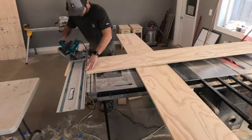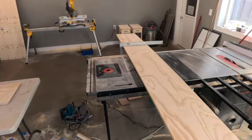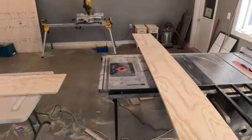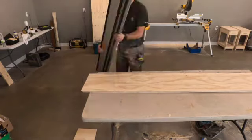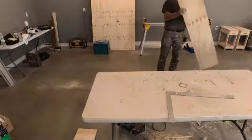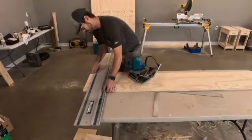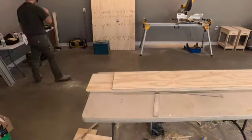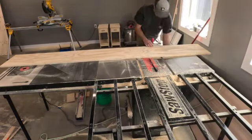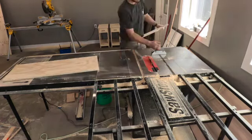For 45-degree cuts like this, I prefer to use the table saw, but these pieces were too long to run through the table saw and I don't have a sled, so I just used my track saw for it. I missed part of this apparently. Before I cut the 45, I cut it straight and left about an inch overhang, so when I do cut my 45, I don't have a long piece of plywood fall off and rip my nice cut to shreds. This Makita track saw with a Diablo blade works pretty good — no clamps and I ended up with a pretty square, nice cut. A woodworker I watched on YouTube said to cut 46-degree angles for big miters like this, so I tried to do that the best I could and I think it turned out pretty good.